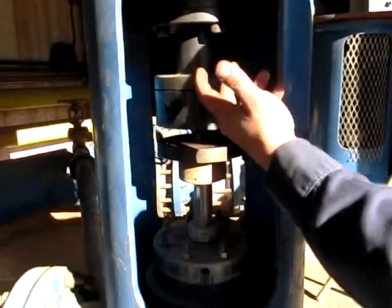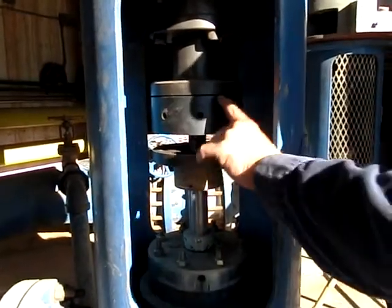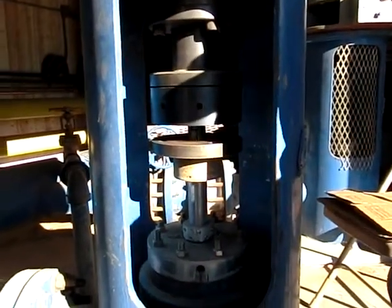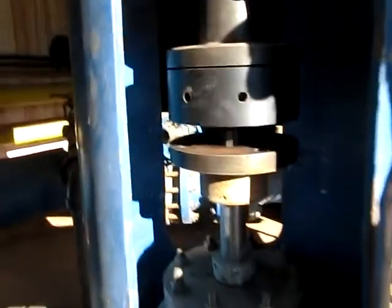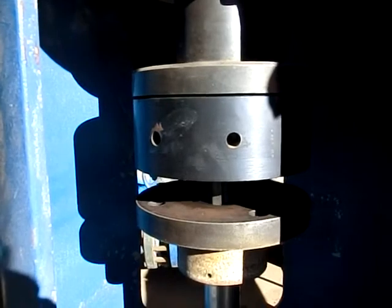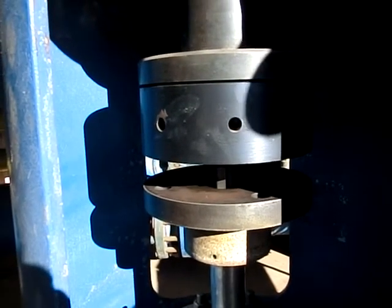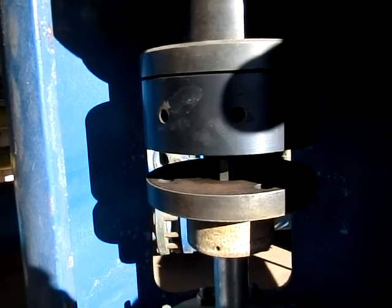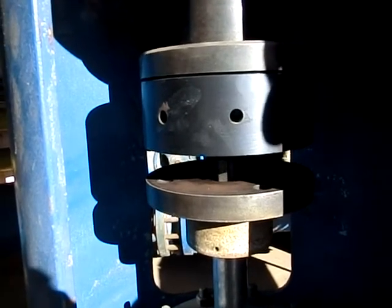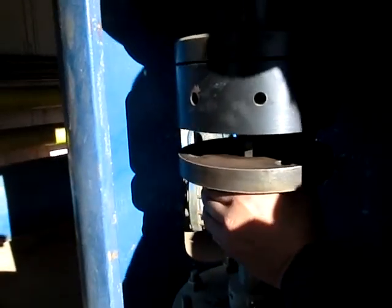What we initially do is we'll pick it up and let it down and see how much travel there is. You want to be at least an eighth of an inch off the bottom of your bowls — that's what we see right here, that crack. So that's the total amount of lift off the bottom of the bowl. But you don't want it all the way to the top either. You want to put it in between, so that's what this is indicating when all this is bolted together here.